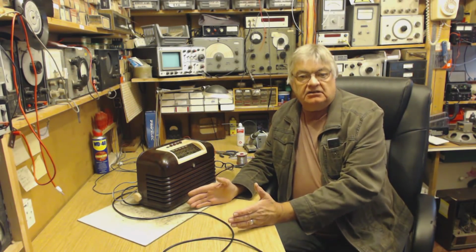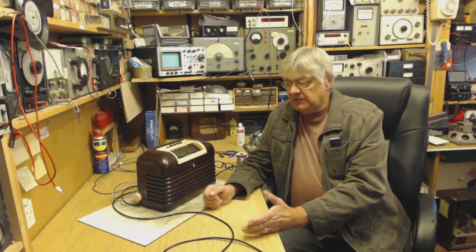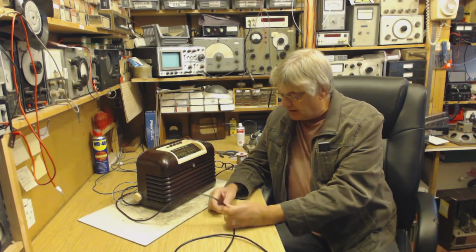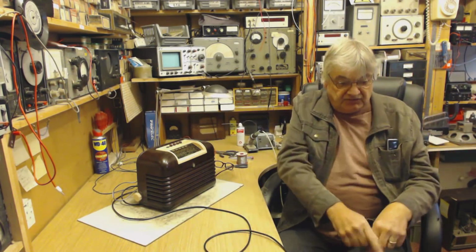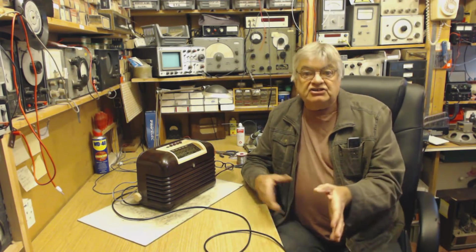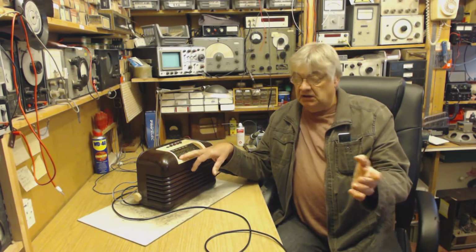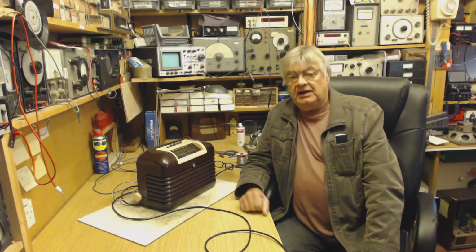Now, with an earth chassis, a type of radio that's got a proper double wound mains transformer, not a live chassis one like this, you would think there's not going to be a lot of interference, because it's earthed. All the metalwork is earthed. You're not going to get interference that way. Have a think about this. Your earth wire, let's say this is earthed, goes to your plug, the socket. The earth wire travels all around the house, all upstairs, around there and down there and around there, eventually to wherever your consumer unit is, and then eventually to a proper earth point, the actual earth, wherever that might be. That could be 40 feet long from the actual chassis all the way around, 50 or 60 feet long. If you think about it, upstairs, around there, downstairs, around there, 10, 20, 30 feet, 40, 50. You end up perhaps 60 feet.